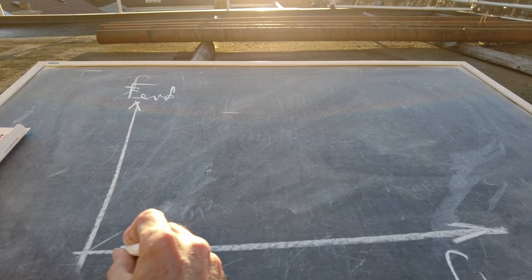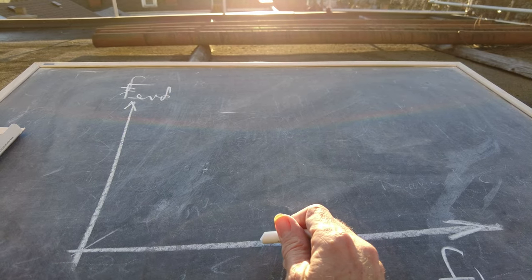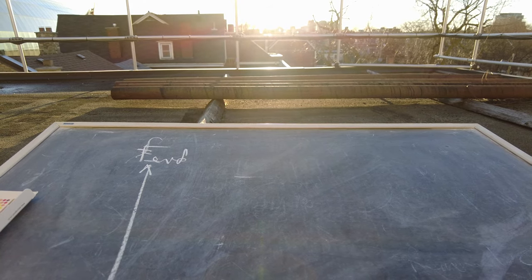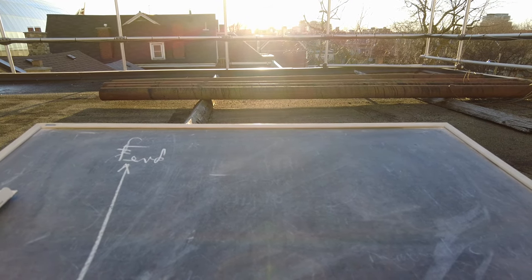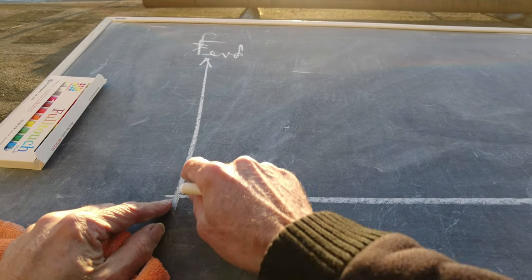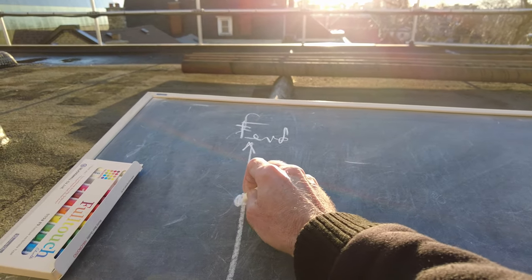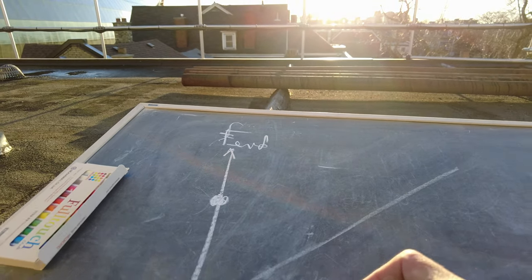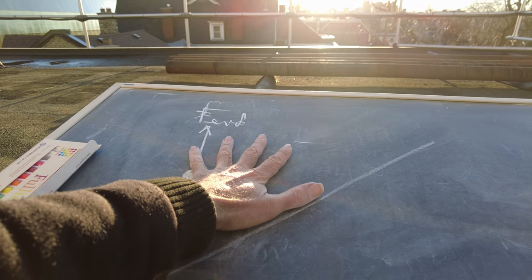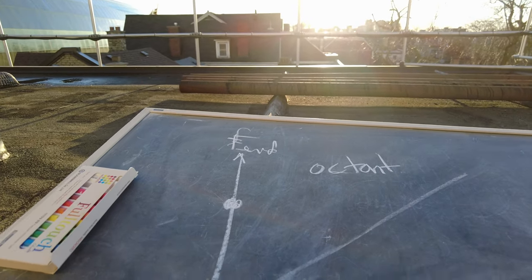Now, if you have something that starts out at a low frequency, say it starts out at 0 hertz, and it goes up to a high frequency, the starting frequency is going to be zero on this axis. And then if it goes to a high frequency at the end, it's going to be here. So you have a strong peak here if you've got an upchirp that actually starts at zero. So more generally, upchirps are going to appear in this octant.